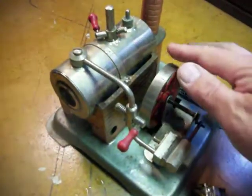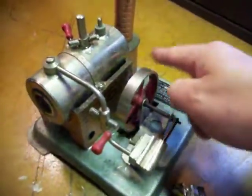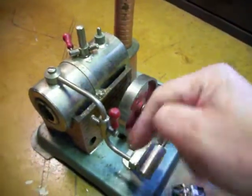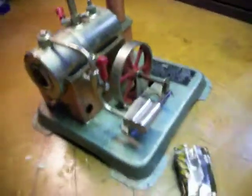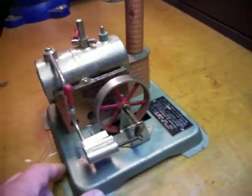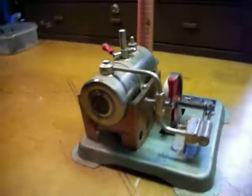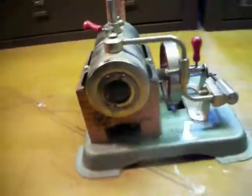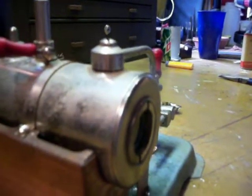Give her another run here — it almost wants to go but she's just not building up enough pressure. We're losing our steam on her. This is a really, really nice model though. She looks like she's really been cared for. A little bit of leaking as you can see coming out through the face of the boiler, or perhaps through the steam pipe — it kind of looks like it's coming out through the top of the steam pipe.